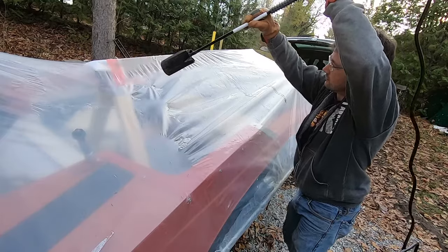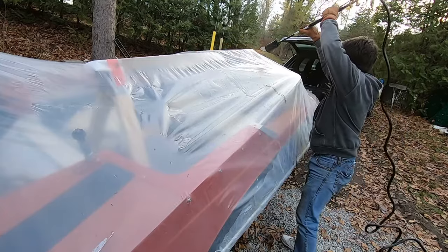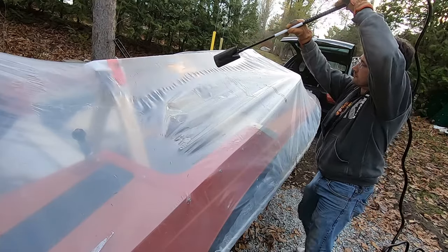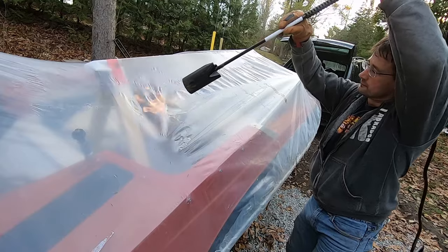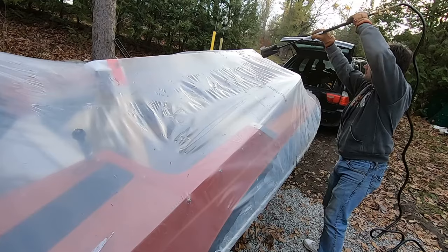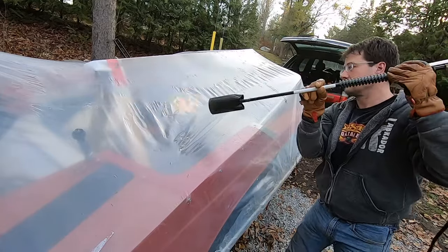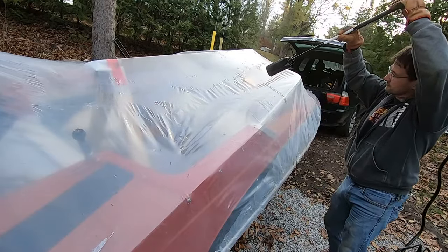You have to be careful, because once you get a hole in this, you kind of have to start over. The holes happen in the areas that are spanning over, like this particular area that I'm shrinking right now. That's where you would get a hole, because it's stretched over and there's no backer behind it. If you recall how I welded the sides there, I heated it up and tapped it against the rub rail. Without the rub rail behind there, or another solid surface, in my experience, it's impossible to join two pieces together without a backer to tap against.